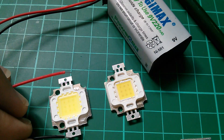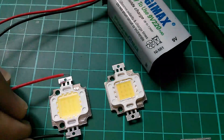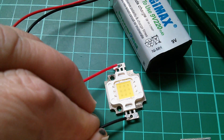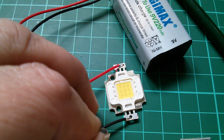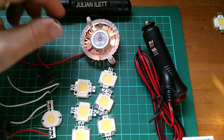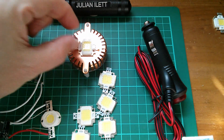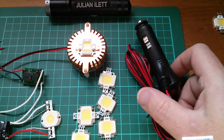I can show this with a nine volt battery. The one on the left is the three by three wired, so that will light up on nine volts — if I touch the nine volts on there, that lights up. This one is the continuous string of nine LEDs requiring about 27 to 30 volts, and you can see that it does nothing on nine volts. So I have most of the kit I need now to do my 10 watt LED tutorial, which is going to talk about using drivers to set the appropriate current for the LED, and using a cheap VGA fan as the heatsink — because these LEDs, a surprise to some people, is that they get very hot. The whole thing is going to run on 12 volts using one of these cigar lighter plugs.